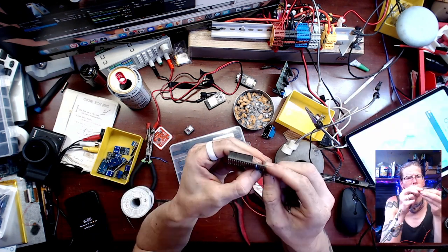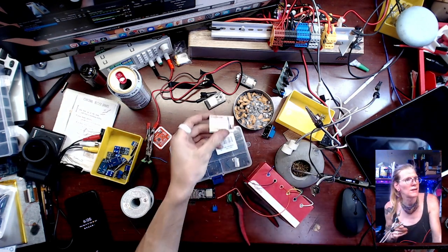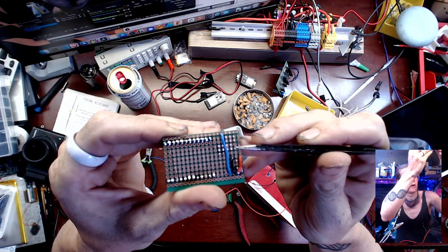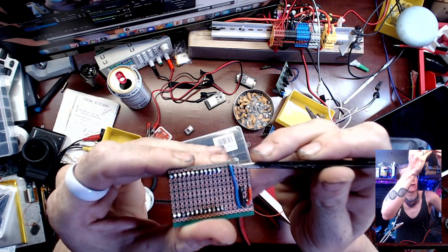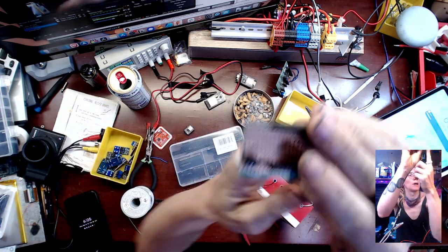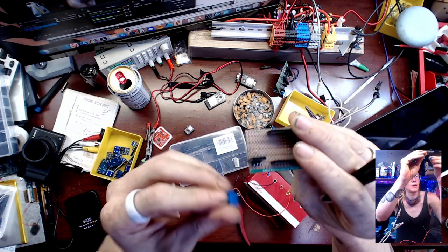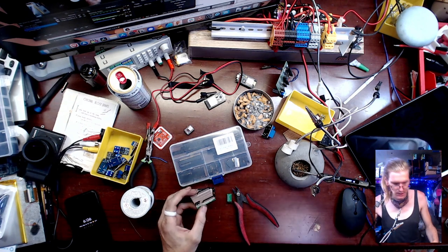And that one here. I'd really love to get y'all a microscope so I can get up in there. This is what it looks like right now. See it? We got power going one over and up a little bit. We got ground coming straight up to there, and then we got our 5 volt output going to this power rail that goes all the way across. And on the bottom, we have the connector for the power supply. After we solder these on, we will put this, which is just a screw down for the power board.